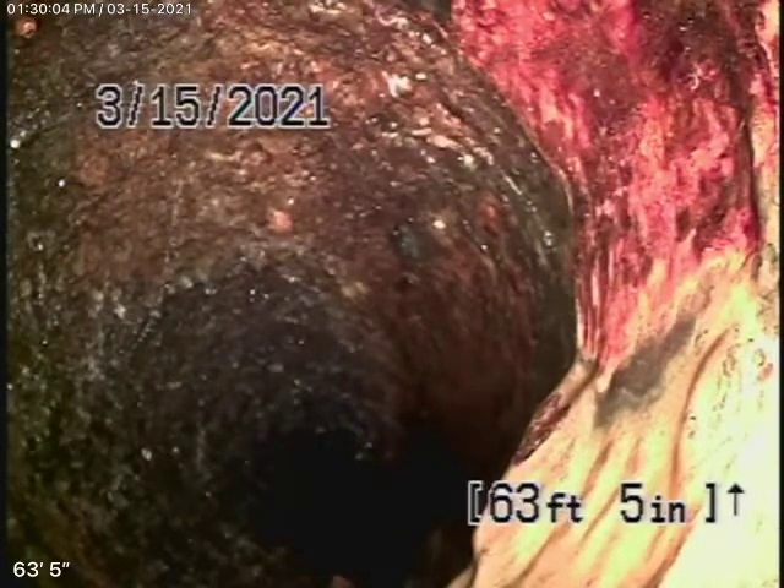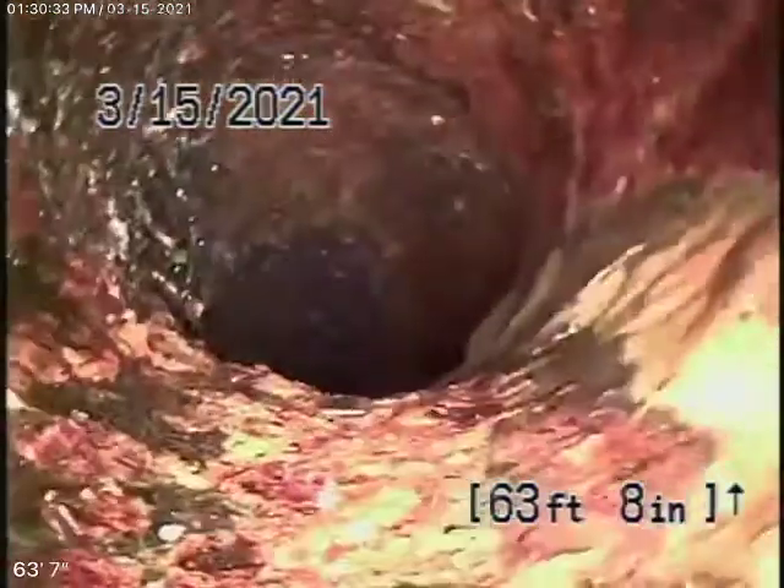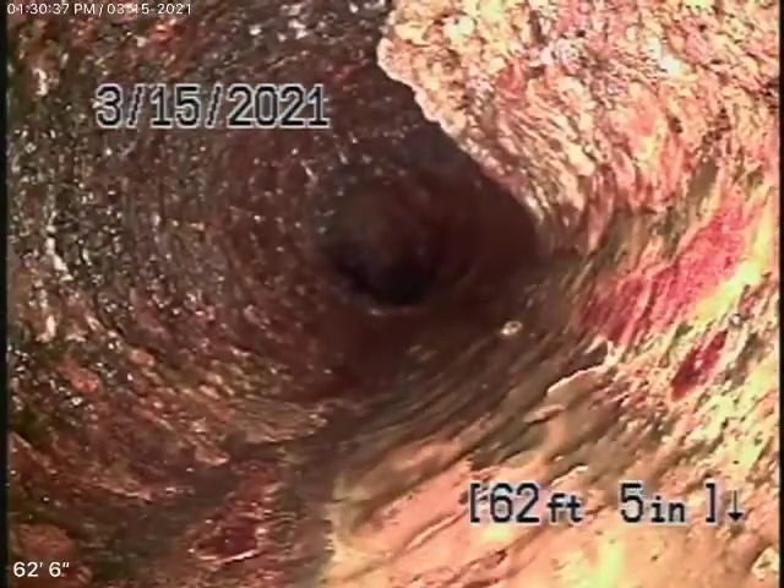There's a clean-out over here. Of course, we cannot check every pipe in the house — you can have your general inspector look around and check as much as he can. The only clean-out available is this one, and we're in about 63 feet, which gets us all the way to the outside of the house on the left-hand side. But we cannot push our camera any further — we've tried, we've run a lot of water. There's just been too many turns in the line. Right now we're 4½ feet deep outside of the house, and you can see it's taking a left-hand turn, looking like it's going towards the street.